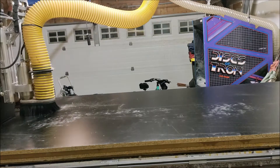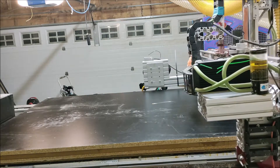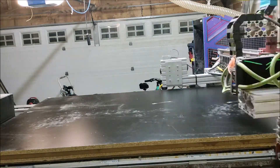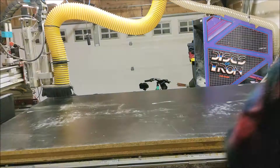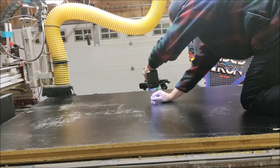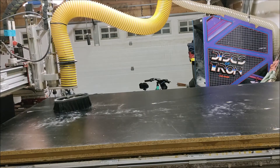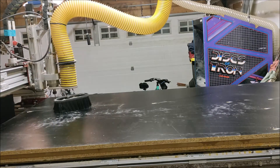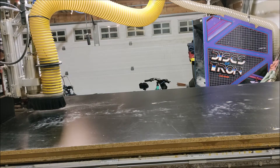There's a shot with the cutouts removed — it looks the same as our original drawings. We're now ready to start our second sheet. This is very similar to how we did our last sheet: it's going to run our toolpath first for cutting our holes and marking where we're putting our screws. Then we'll turn the machine off and put our screws in to make sure the wood is held down nice and tight. This time I'm going to do it correctly — I'll use the touch plate to measure my height and make sure everything is set correctly so I don't have to run it twice.